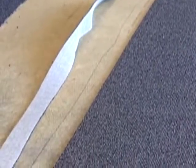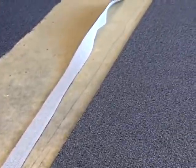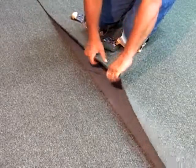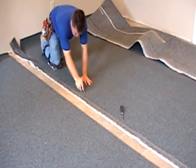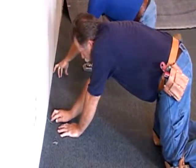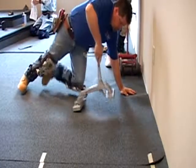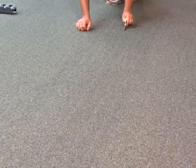Seam edges shall be trimmed using tools and techniques best suited for the carpet. Trim edges far enough into the material — normally about 8 to 10 rows — to maintain the structural integrity of the carpet. The cutting technique for this backing system is row cut on both edges. Correct pattern matching, gaps, and overlaid areas with use of a knee kicker, power stretcher, dead man, mini stretcher, and stay nails. Pattern carpets must be cut by the row cut method.